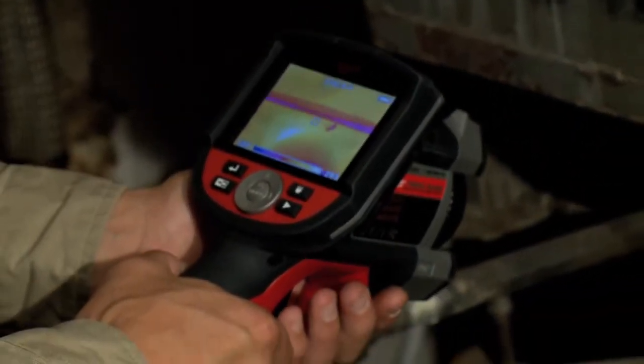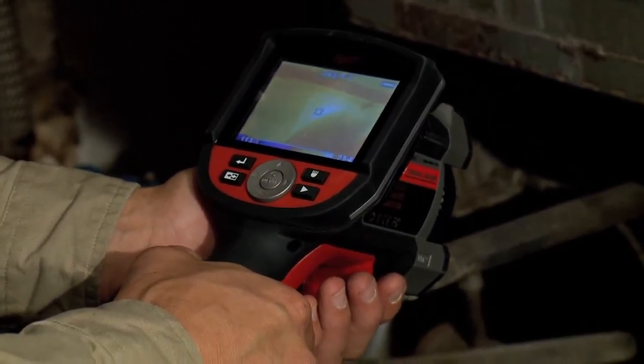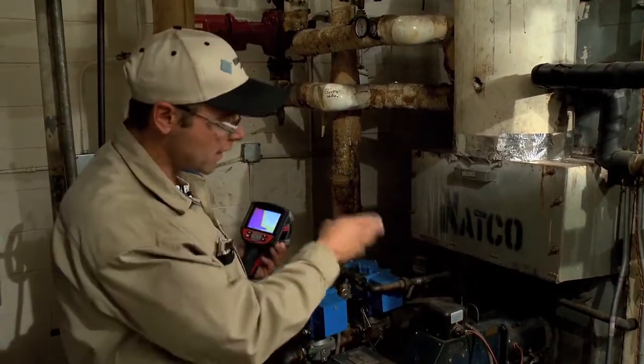Although what I am seeing on the front of the burner — the nose cone of the burner — I'm seeing a hot spot. That indicates that there's some internal refractory that probably broke down, or internal insulation in the boiler, or that my flame pattern may not be even. That's something that I'll have to address here today.